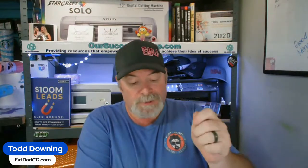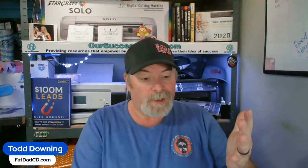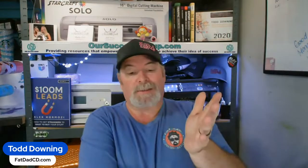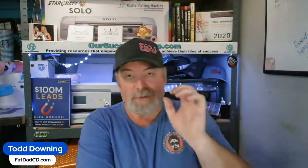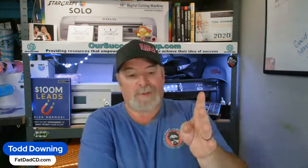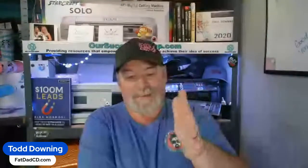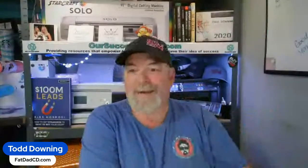Now, the IR lasers, those are precision masters, and they are great for materials where accuracy is really paramount, but they can be overkill for some projects. And then the fiber lasers, those are going to be your metal monsters. If you're looking to do metal exclusively, then fibers are where to go, because on some of that other stuff, like the plastics and organic materials, it's just not going to be the best thing for it.